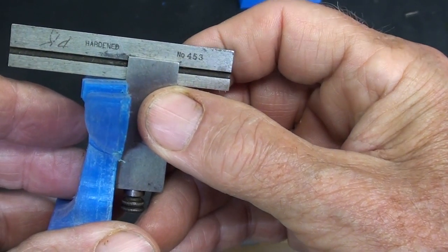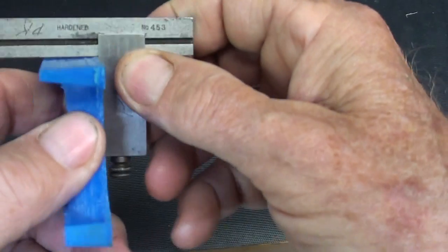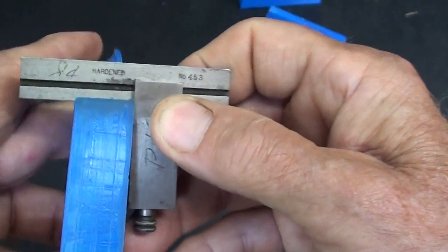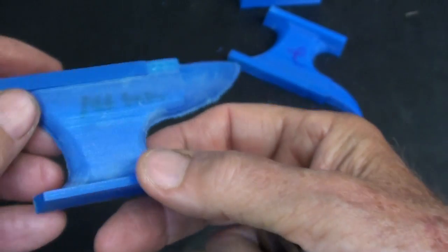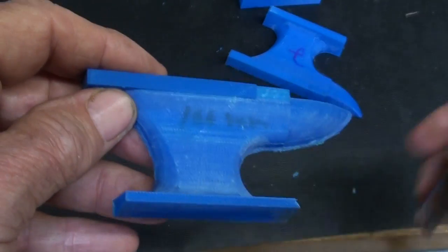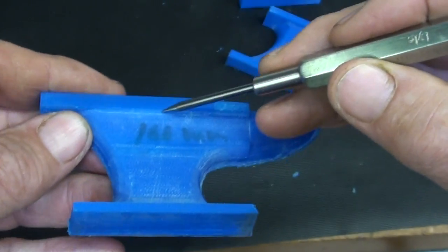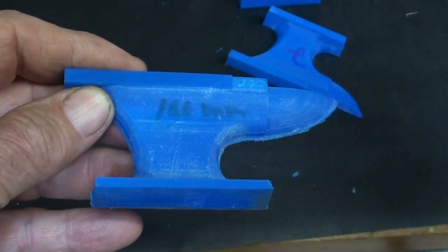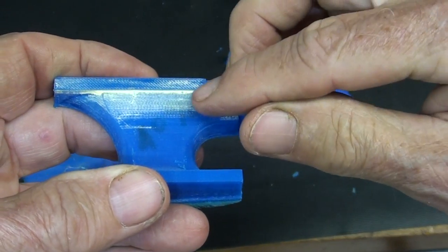This is a foundry pattern, so there are three degrees of taper in every direction so that it will withdraw — we call that draft. That's one of the hard things about making wooden patterns by hand. Even though there would be three degrees right in here, we really do not like those sharp corners — that should be filled a little bit, so there's a fillet. That's what I was playing around with using the wood putty: I have a fillet there.